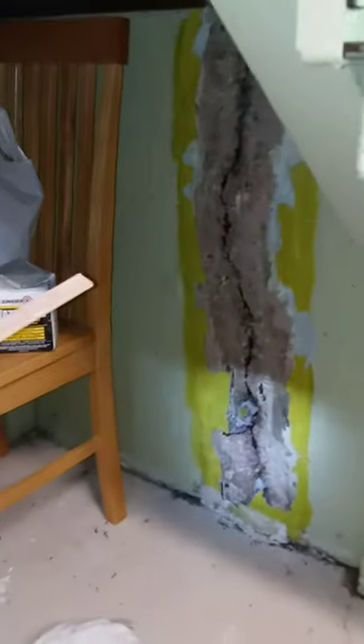We're going to seal up this foundation crack using Zinsser watertight hydraulic cement. We've mixed this — it's supposedly a two-to-one ratio, but I've found it's actually closer to a two-and-a-half-to-one ratio to get something decent. Make sure to wear the rubber gloves — we've had a lot of leaks in here lately.